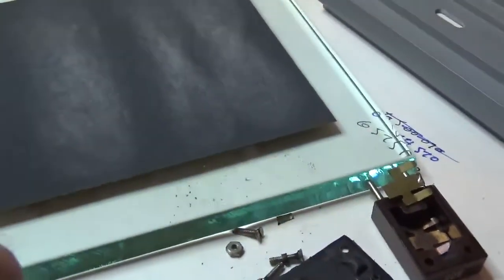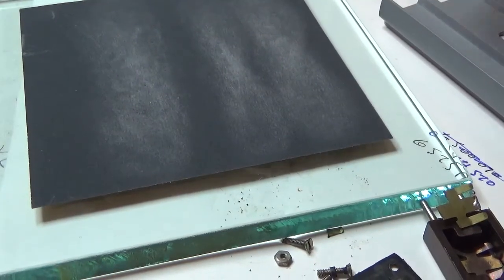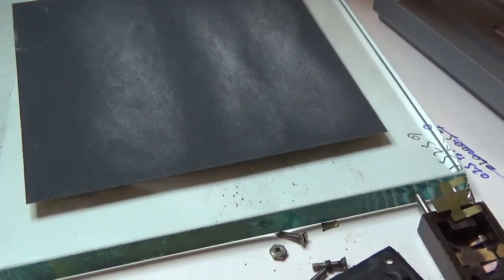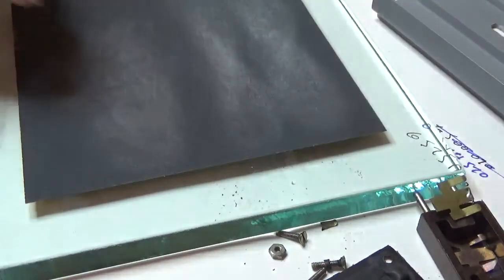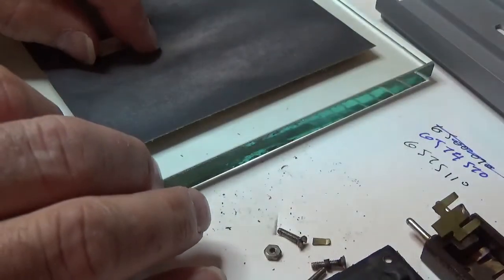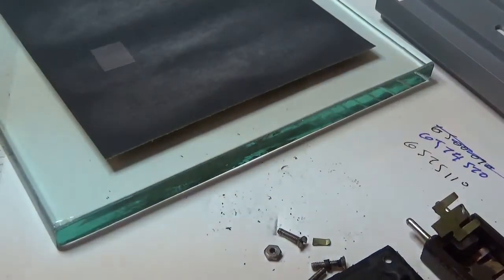And I sort of designed it to be out of band or very low in the band. These are cut at 1,000 parts per million, so they can vary by 7,000 or 8,000 during manufacturing, but they also vary in the actual oscillator circuit that you have it in. Because every oscillator circuit is going to add a little bit more or less capacitive loading to the crystal, so it's going to change where it operates.